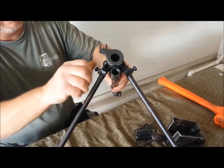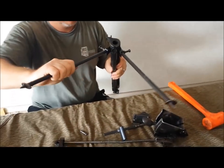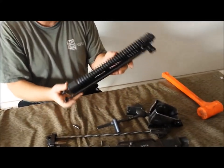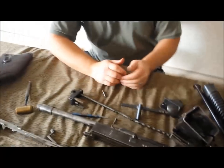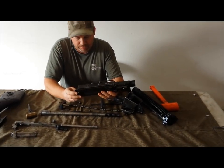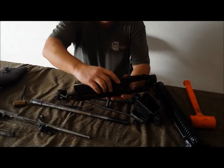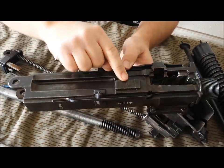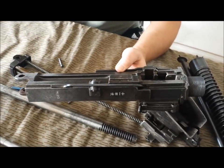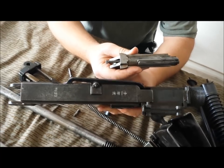All that's left is the front bipod. I have a couple of pins that allow further extension of the front bipod — these snap back down when not in place, and otherwise fold up. That is the front half of your gun. The gun is actually completely disassembled down to basically the bare receiver, minus the ejector. You've got two blocks on either side, and these are what allow you to basically adjust your head space on the gun for your bolt when it's completely in battery position.